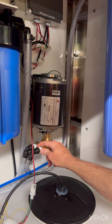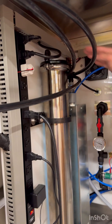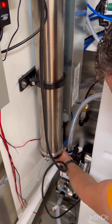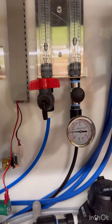From the pre-filters it goes through to your processing pump, and from your processing pump it goes to the top of your RO. Through the RO, the blue line is your good water and the black line is your drain water, and those lines come here.